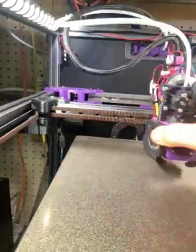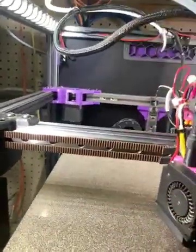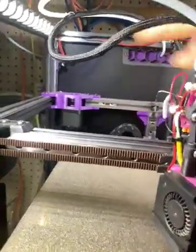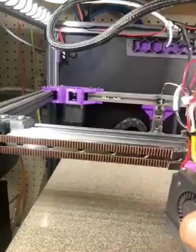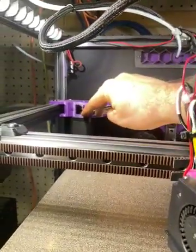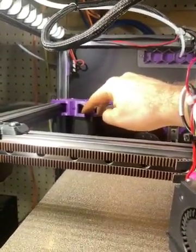After tightening that one screw, move the tool head forward and backward. You'll see the belt move to a new position. You don't need to move the tool head left and right — just gently forward and backward and you'll see the belt settle in its new position.